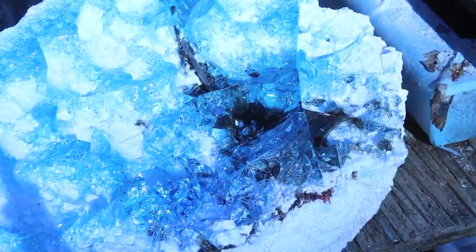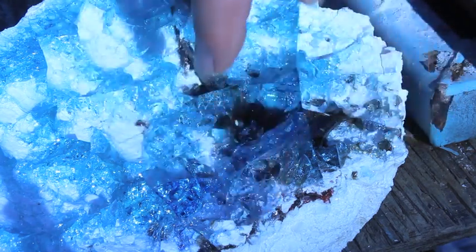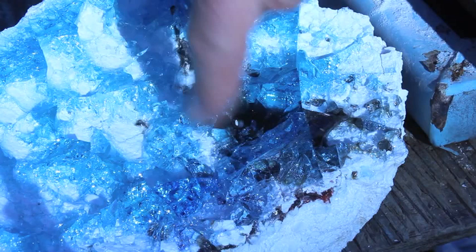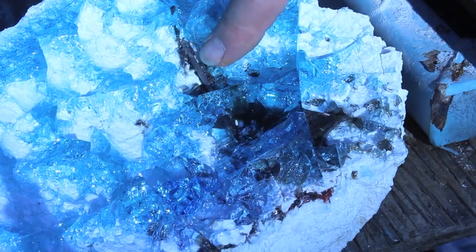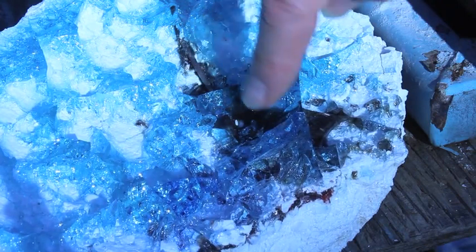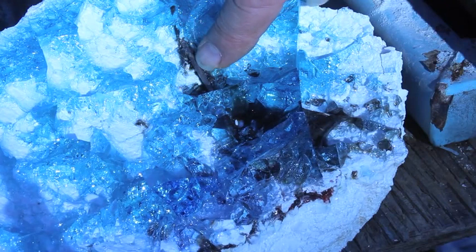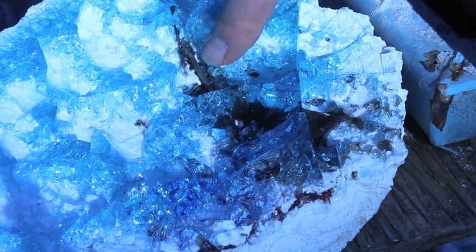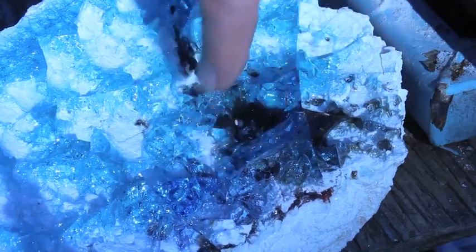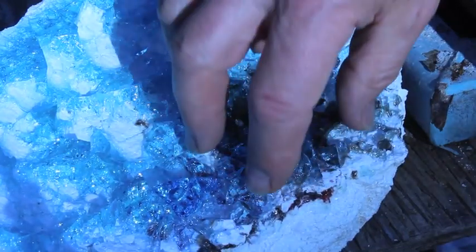Here's a chunk of the bottom of the crucible. When I was busting it up, I found this region full of really dark olive green glass. Sure enough, there's a 3½-inch framing nail sitting in the bottom of the crucible. I have no idea how that got in there, but because iron oxide creates the olive green color, the oxide coming off that nail made a little patch of really dark olive green glass in the bottom of my pot.